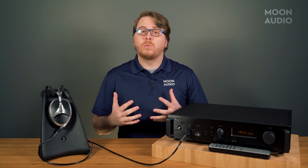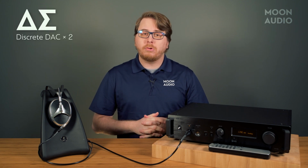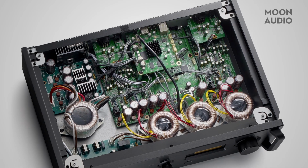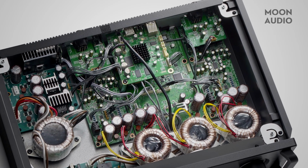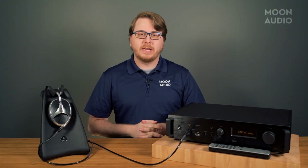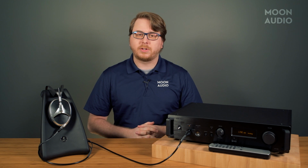They're good at it too, which is why they've designed the UD-701N with their own Delta Sigma discrete DAC. They use discrete circuitry using FPGA and incorporating their original algorithms. It's impressive to say the least, and TEAC is proud of their sonic performance given their unique discrete DAC design. It sounds amazing, and we'll get to more of that in the sound impressions.